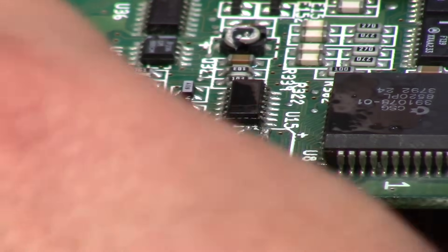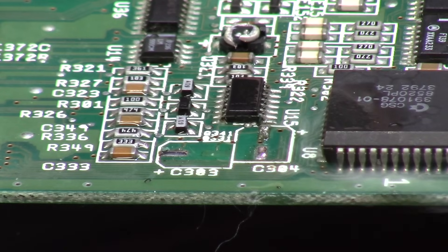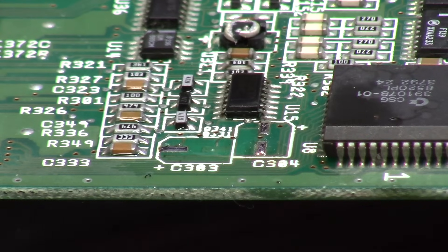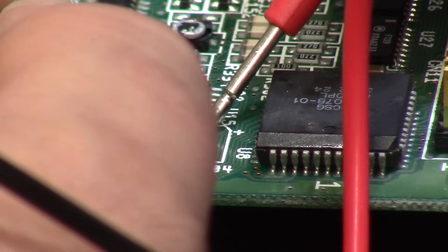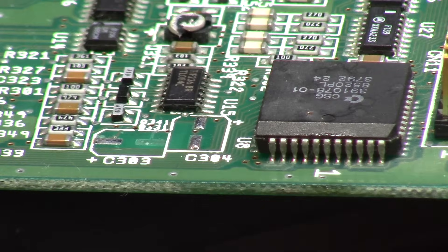There's a little ball of solder in the hole. Let's carefully flux this and get those legs out. That's from excessive heat or just bad technique — you might have pulled an Adrian and twisted your cap off. This negative goes to this positive — it's like a series cap. I'll fix that. That cap is just done in series.